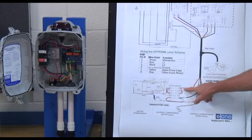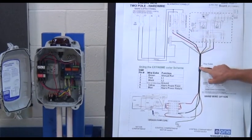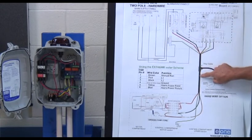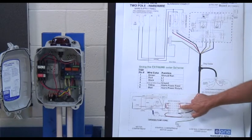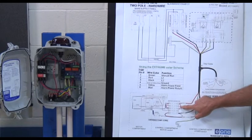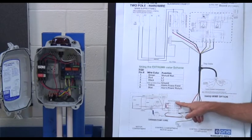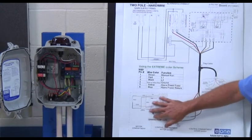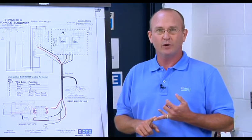The red L1 wire comes off the double-pole breaker inside the alarm panel, comes down through the cable, and splits at a T. One side goes into the level sensor assembly and ties to pin one of the on/off switch. It also comes down and goes to the 1L1 terminal on the contactor. There are series jumpers tied to 1L1, 3L2, and 5L3 — using three sets of contacts to transfer one leg of power across and get 240 volts applied to the motor. There's really only one thing that needs to happen: get that 240 volts to the pump motor so the pump will come on.